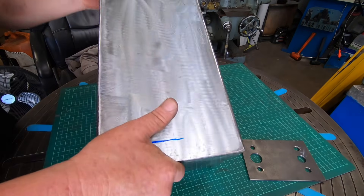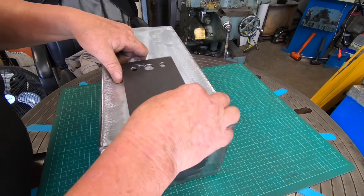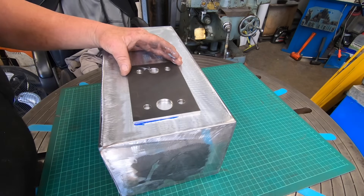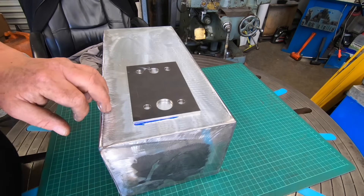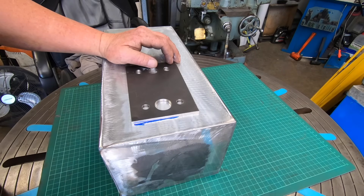So what I've got to do now is mount this up in the mill and drill these holes — transfer these holes through. That's a good thing in a way because that won't rust. I've got to put a tap in the bottom so it can be drained. I haven't got a tap so that can be done at any time.